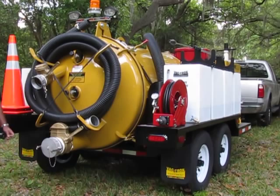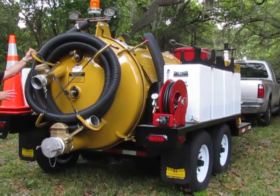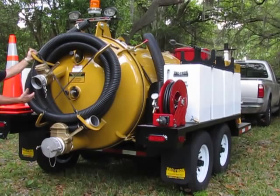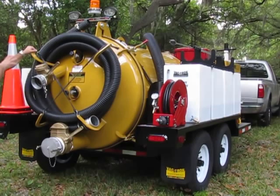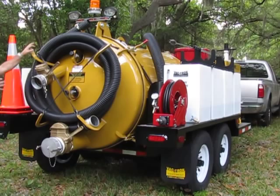Of course, for unloading dry materials out of the tank, the hydraulic door, which again I'm going to demonstrate here in a moment, will open up once you've released your latches all the way perpendicular to the tank. Makes it very easy to clean inside. Then you have a full tilt dump to about 60 degrees. All the material will slide out. There's a polymer liner on the underneath side of the tank. That's what helps the material slide out.